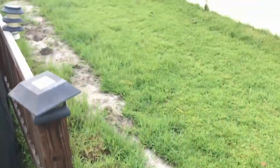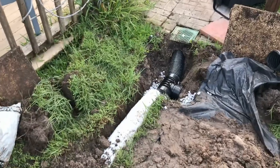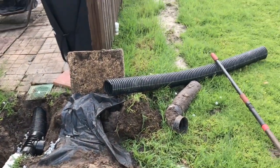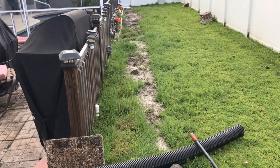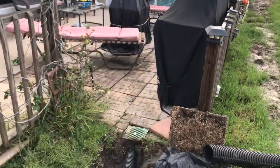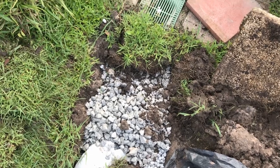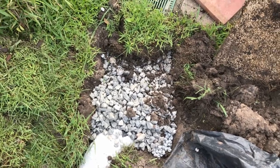You can see how quick that was — we just put a little soil back to help hold that sod, then we'll haul the excess away. We put a T on to connect to our existing drain. The yard is still settling — it wasn't that great to begin with but it's working really good. I added just a little bit of gravel here to help water perk down through that one section. It's solid pipe underneath but the water will still get through the gravel. No need to wrap it — it's just a tiny section. Now we're putting our sod back.